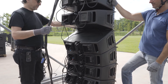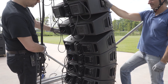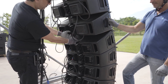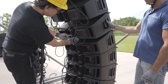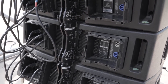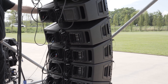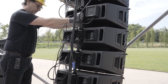First, insert the two front pins, and then lower the cluster until the fourth module rests on the fifth. We insert the hooking bracket and its pin in the white part, in the position indicated by the project — in our case, position 2.7. Let's make sure that the suspension pins of the last modules are properly inserted in the position indicated by the project, and at this point we can lift the system, which will take its final shape.